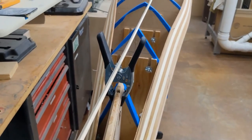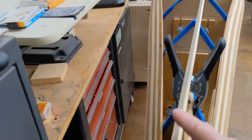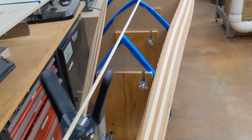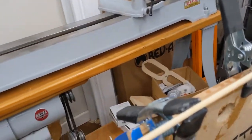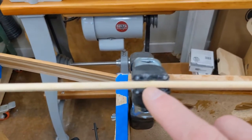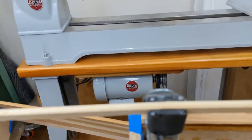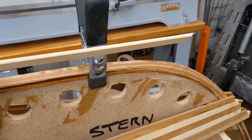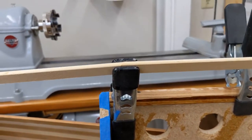As you're putting glue in these joints, you want to have the other piece sitting up here ready to go. On a round boat it just wants to slide off, so just put a clamp upside down at each end — that holds it there for you. Some of these pieces are not as long as I want them to be, so I had to do a scarf joint — a 45-degree bevel — and those two pieces are glued together, letting them sit for an hour or so. I just needed that extra foot to get to the other end. It won't show up in the final product because the wood is so nicely color matched — it'll blend right in.